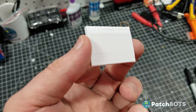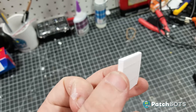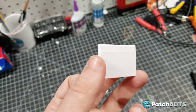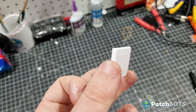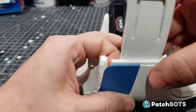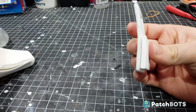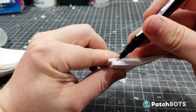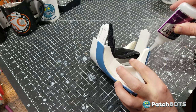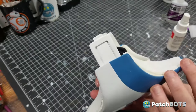I printed a little spacer piece that will fill that space but still leave some room for the support strap to come in from underneath. These spacers are 3 millimeters thick versus the KW foam which was about 5 millimeters thick — this will give me a little more room for my knee based on my test fits. The spacer is going to line up with the top of the armor piece and the clip is going to line up with the top of the spacer at the base of this indented design. We can see this will leave a little overhang on the clip, so I'm going to cut this off on an angle to allow more room for the strap to go around the knee. I then glued everything together to make a clip-spacer-foam-armor chunk that all fits within the footprint of the outside of the armor.